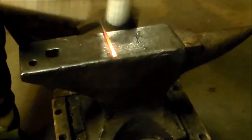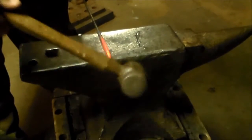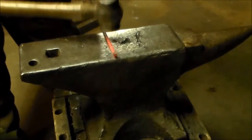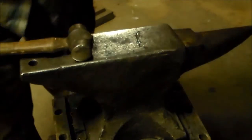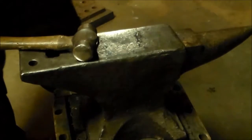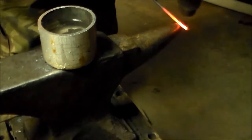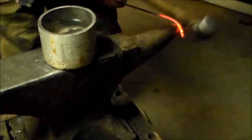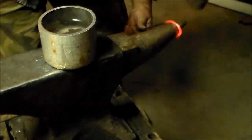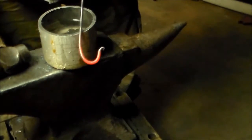With this little piece, I'm just going to flare the end out, bring it down the side of the anvil a little, and bend it back on itself — just like that. That's going to be the end of my hook. I'm going to throw another heat on it. Now to make the hook, I'm going to quench the end I did so I don't destroy it, take it to the horn, bring down the back side, and shape it up a little. There's the hook.